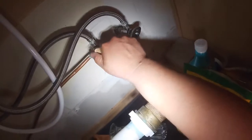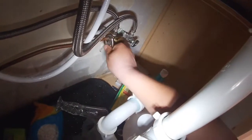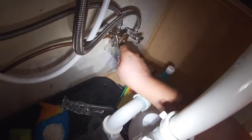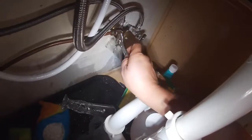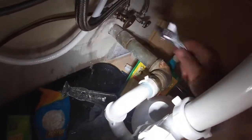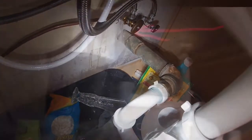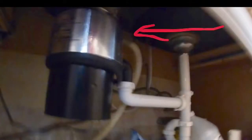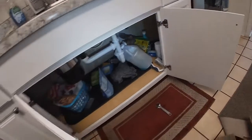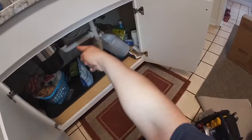Make sure you find your main water valve in case of any emergency. Go ahead and close your water valve, then start removing your water line from your dishwasher — I believe this is a 3/8 copper water line. Sometimes it will still leak water if the valve doesn't fully shut off, so always be prepared for water to spill. Remove your drain line from your garbage disposal or your regular drain line.